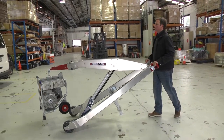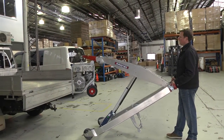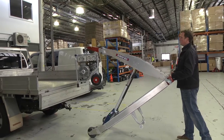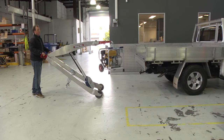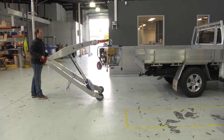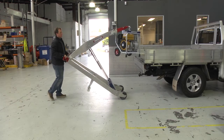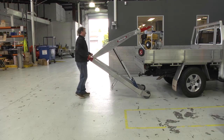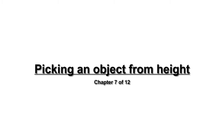The hook swivels very easily, so the complete hook operation can be handled from the user at the handle end of the PHT. Always keep your hands lower than your chest. This is a very important rule because as the handles move higher than this point, the load becomes heavier and it moves further away from the front wheels. That is, the leverage has reduced and the load on the handles becomes higher.